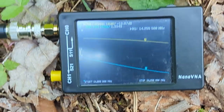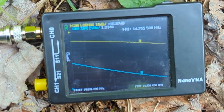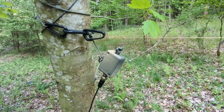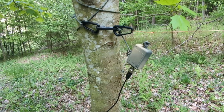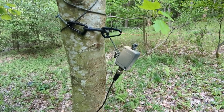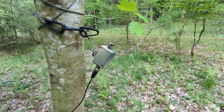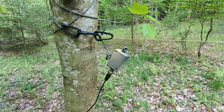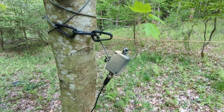If I want to use exclusively 20 meters, I just roll it into the 20 meter knot and then it has a nice resonant dip in the lower portion of 20. Disconnecting everything is the fastest NVIS type antenna I've used so far — it's just a matter of disconnecting all the hooks, winding the coax up, and using the handle on the chalk line to reel the actual antenna wire back in. I always focus on lightweight and speed, and this is my best version yet.